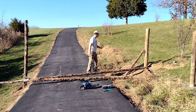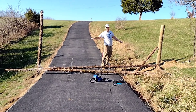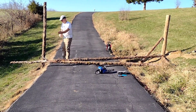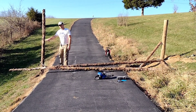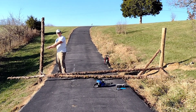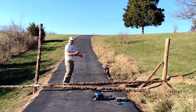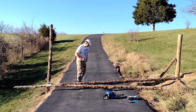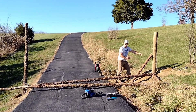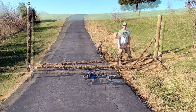I've got this one over here; it's a brace because this thing doesn't weigh a ton but it's long, so it'll be pulling on it. On this side, when the gate opener pushes it, there'll be a little ramp here — a triangle with a lap piece — so it'll push up and kind of sit on that. So it won't really be hanging on there, but as it's swinging it will be, so it's important to brace it. I've got that down in the hole; I'll get it lined up and I'll pour the concrete here, and then we'll be able to hang the gate.